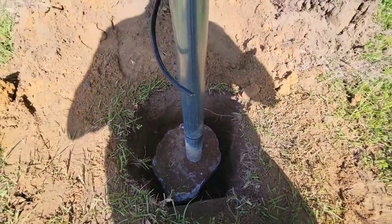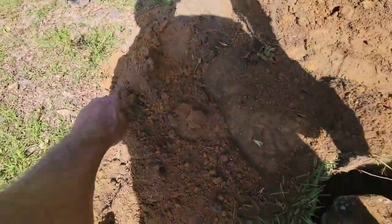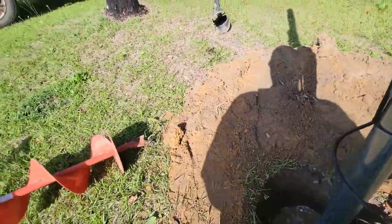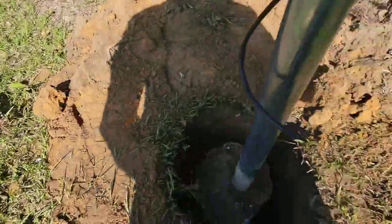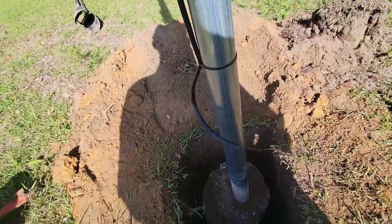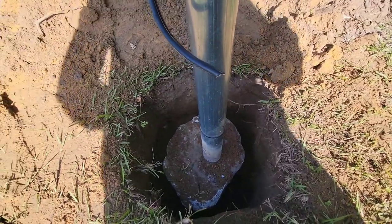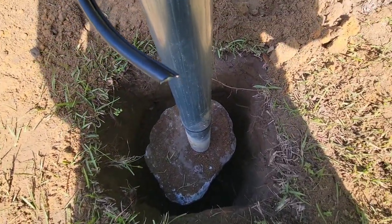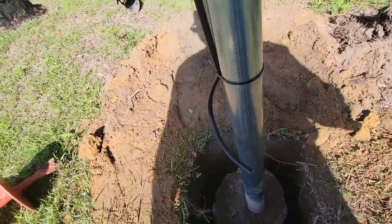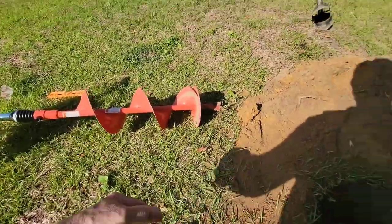All right, got my pole in the ground after a little fighting with the auger. Had to cut through a bunch of roots — piles of roots. In a way the auger was good for basically getting the hole started; I had to do the rest of it with the hole digger because of all those roots. Nevertheless, I got seven more to do. What I do — I keep the same original concrete. You got a point at the end at the bottom where there's no concrete, take your pole, stick it in there, take a piece of wood, set it on top, take a hammer and tap it.